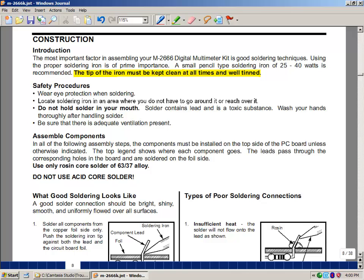In the description of the video, you'll find a link to another YouTube video on soldering. I would like you to take a look at this. But one of the key things you'll learn in this video is that we need to keep the tip of the iron clean. We're going to do this with what looks like a little ball of steel wool. And then once you do that, we're going to tin the tip.